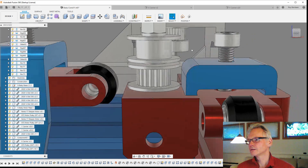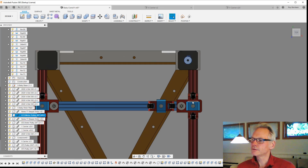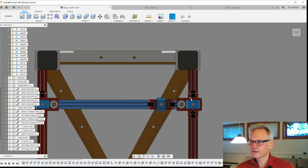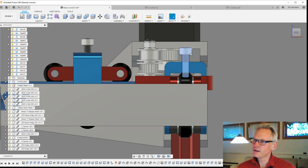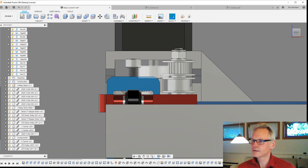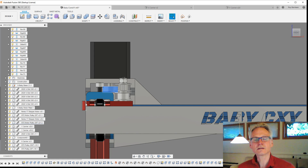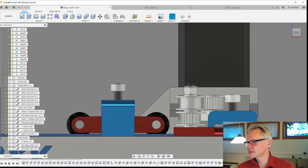Then we have the outside loop of the pulley — that's going to just pass through the Y carrier, so it needs to go either through it, over it, or under it somewhere. At this point we cannot really pass it — this screw is in the way. And also, if you look at the other side, there's no place, because the other side is going to pass lower than on the A side. So the B side path is not on the same level — it's on another floor, you can say. This is the lower path, and the A side is the upper path.